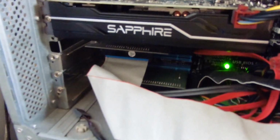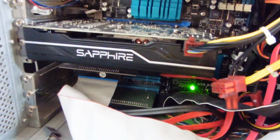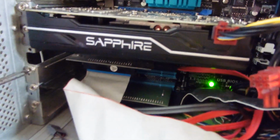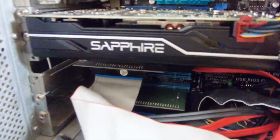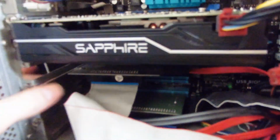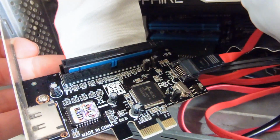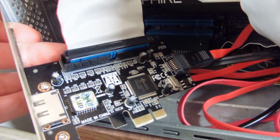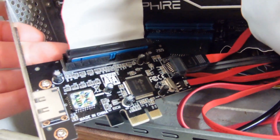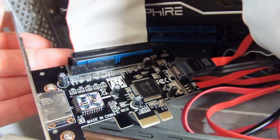So I'll just switch my power supply off, make sure that's gone down before I can take this off. We'll see when that standby light goes away. I'll just start unscrewing this. There we go. So I'm going to pull this card and see if there's anything fishy with it. I mean, we've got a bunch of little capacitors on here, and I wonder if some of these maybe have gone bad, because it was a pretty cheap one. I think it was the cheapest one I could buy on eBay at the time. I think it was about $15, and it is almost 10 years old. So if all those capacitors are dead, it really wouldn't surprise me at all.